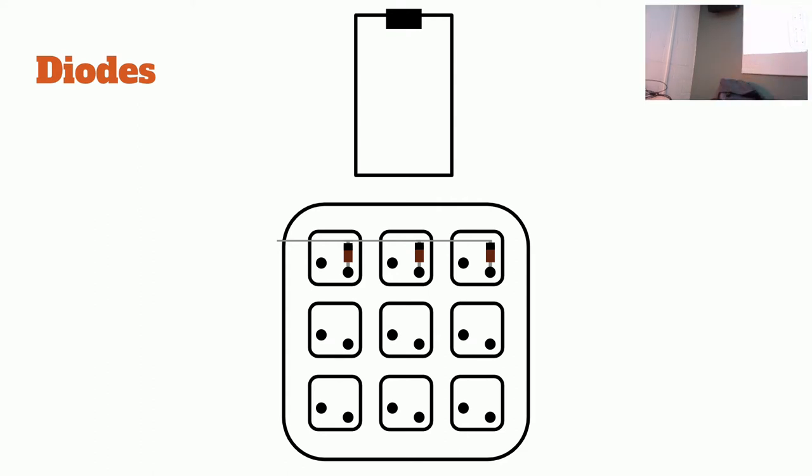So, it doesn't have to be. You're going to end up soldering it. Yeah. Oh, you gave it to me. Yeah. Yep. So you'll probably want to grab some pliers and just tighten that a little bit, but it really shouldn't matter once you actually have solder on that. Get all of your diodes laid out. Get the three diodes laid out, and then you can solder them.